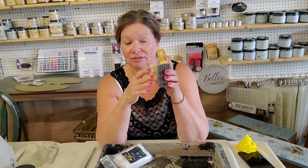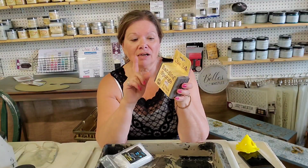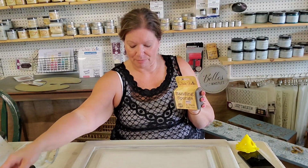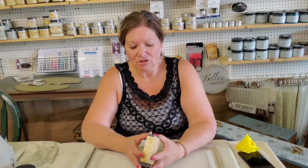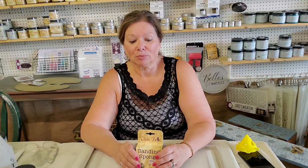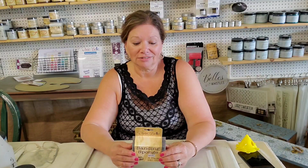We didn't talk about sanding. So these are just sanding sponges. I think it's best to use manually, because these are nice because they fit in all those little grooves of the cabinets. You just want to do a scuff sand on them. There's no need to do all this crazy sanding, but just a scuff sand before you get started, and also in between coats. Your client's going to want a really smooth job, and that will do it. Again, things that I've learned as I've gone along.